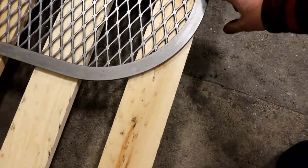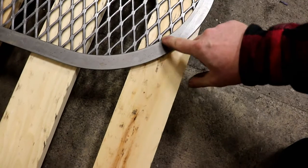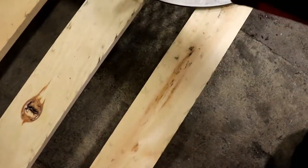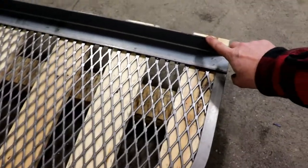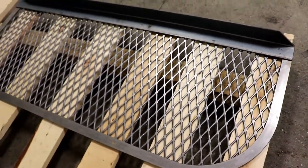This is how I'm going to make it. I got this all cut out and it's going to get tacked underneath. It's a half inch shorter, cut out to that size. Then I'm going to take a one inch piece of flat bar and wrap it around there and tack it on the inside, so it'll stand up one inch. This mounts to the back of the wall. They wanted a two inch piece here so I just used two inch angle iron. And then we'll get a powder coat of white.